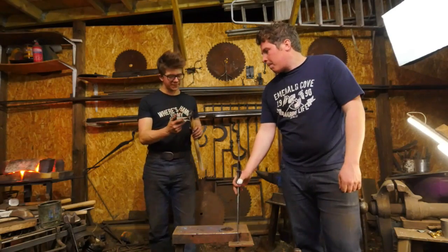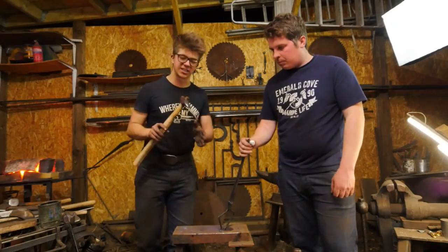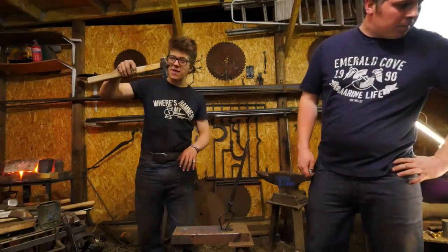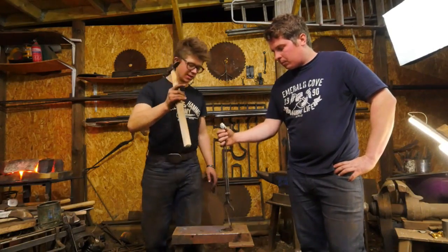And obviously that V-tip punch, it's like a V-tipped slot punch. It's wonderful because we can line it up on a center punch mark and get a center. It's a little easier poking that and then moving it than it is poking a flat punch with a flat bottom. And it's a lot nicer than using a slitting chisel to poke a hole in a tool.